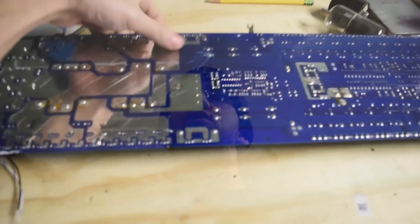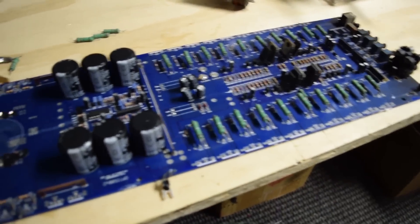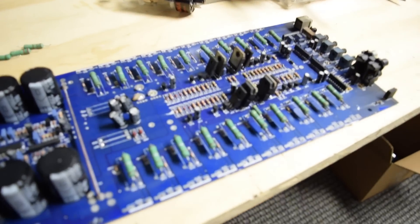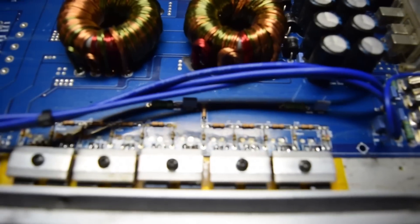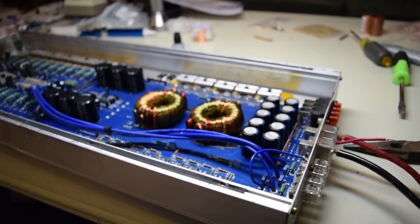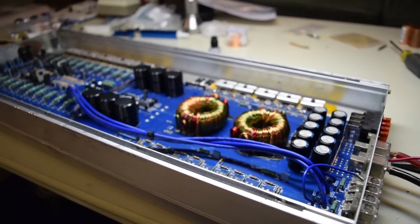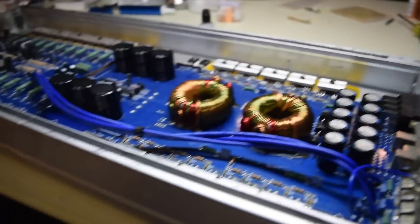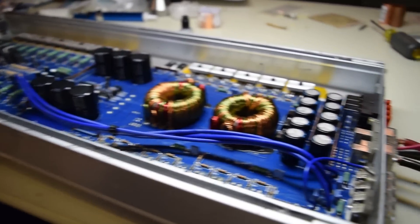The first one did not turn on at all - there was a lot of soot and a lot of damage, so no use fixing it. I just gutted it, salvaged the parts - kind of the engineering version of a sky burial. This one, however, I repaired and replaced all the MOSFETs. It was my first time trying an amp repair, and I want to give a huge thank you to Jeff Moush who was helping me and walking me through the whole testing process to bring this thing back to life.